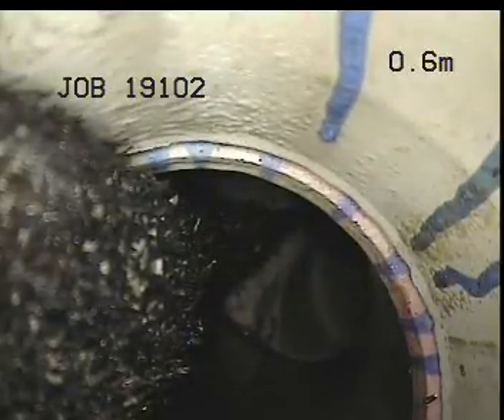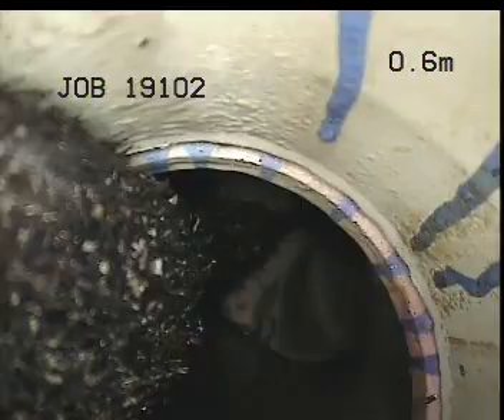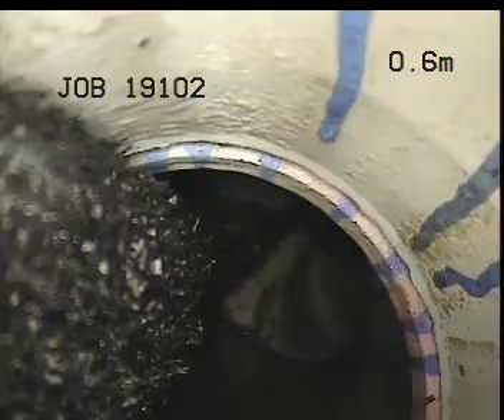So there are the roots and tails here that I had mentioned that we could see from the horizontal section of drain, and that is the junction. I believe this is what was causing the actual blockage to occur, but I'm just going to continue to see if I can work past that. I'll also see if I can possibly jet rod this section of root out as well while I'm at it.